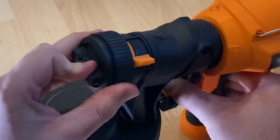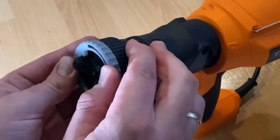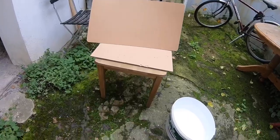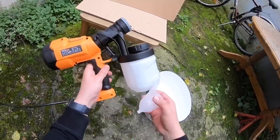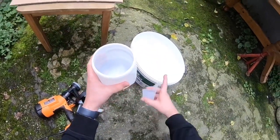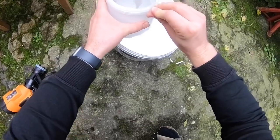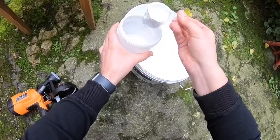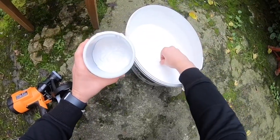Spray with lever. HVLP sprayers divide the air power into two parts, one for pushing the paint to the nozzle, while the other is for atomizing the paint. Unlike other brands, they have a spray lever that adjusts the air pressure near the canister and nozzle to control the spray width. When the viscosity of the coating is high, you can turn it down to increase the pressure inside the canister so as to get more power to push the paint.